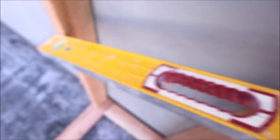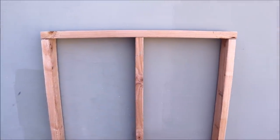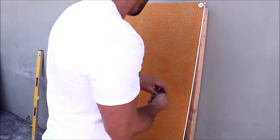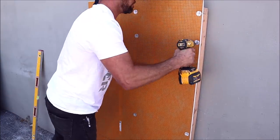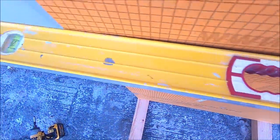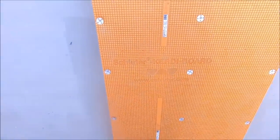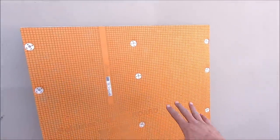There's a big gap in that middle stud. Let's quickly show you what happens if you do not address this stud — this is what it looks like if you do not address your backer board and framing. A very large gap. You do not want to have to make up that gap with thinset mortar; not only will the end result not look as good, but it will take a lot of time. Let's quickly wet shim this stud so that we can obtain a flat wall.